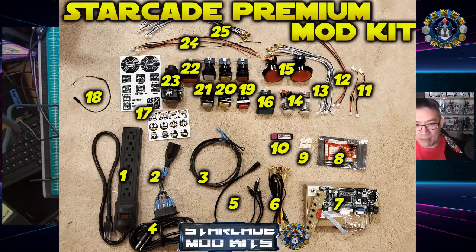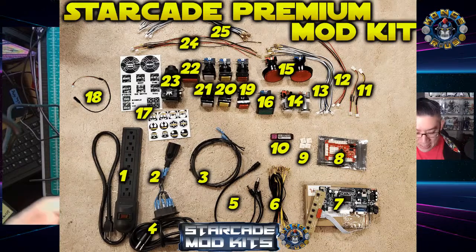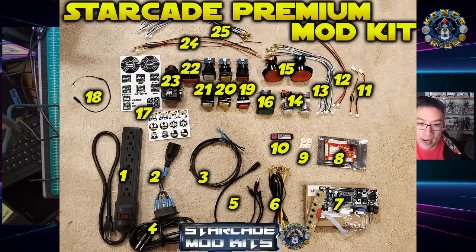13, 24, and 25 are all encoder wires. And then 14 through 22 are all the different buttons that I have: the big 60mm red buttons, the square buttons, and I use these chrome buttons. And 23 is the joystick, which I'll show you guys. I use a 4-axis basic joystick. And then I include graphics for the buttons. Number 18 is for the sound. So that's everything that's included in the mod kit.